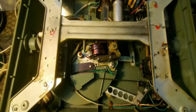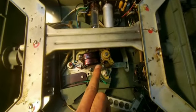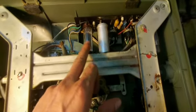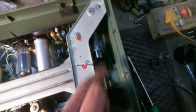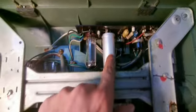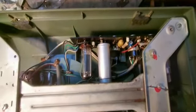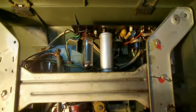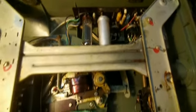This is the inside picture of this record player. You can see this is the main transformer, this is an AC motor, and this is the rectifier valve, the preamplifier valve, and the power amplifier valve. I need to check the values of those. These are the filter capacitors — they are very old and I don't think this capacitor is working well; I might need to replace it and check all the components as well.